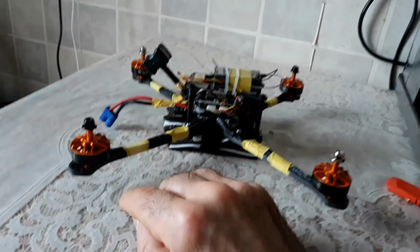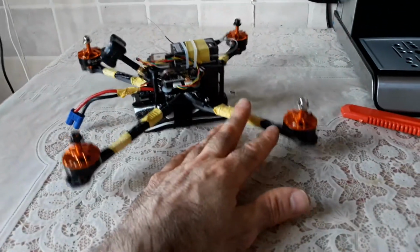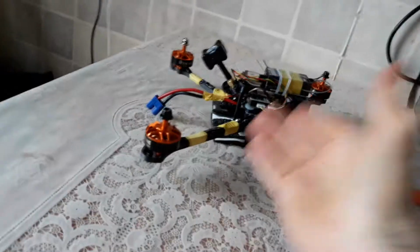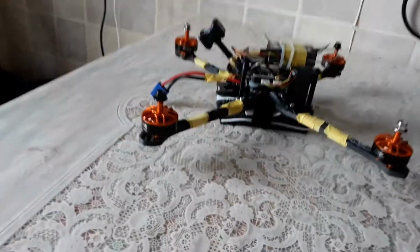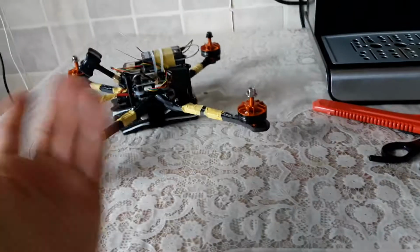You know it's 25 milliwatt because it won't get hot. You leave it on the ground, put your finger on the top, and you will notice it's not really hot. Then you are on 25 milliwatt. Unfortunately, there is no proper paper to tell you it's 25 milliwatt. I did guess, I'm sure it's that. And then for the channel, you press a step. You press one and repress and repress till you get your favorite channel, if you have one. Otherwise, leave it whatever it is.